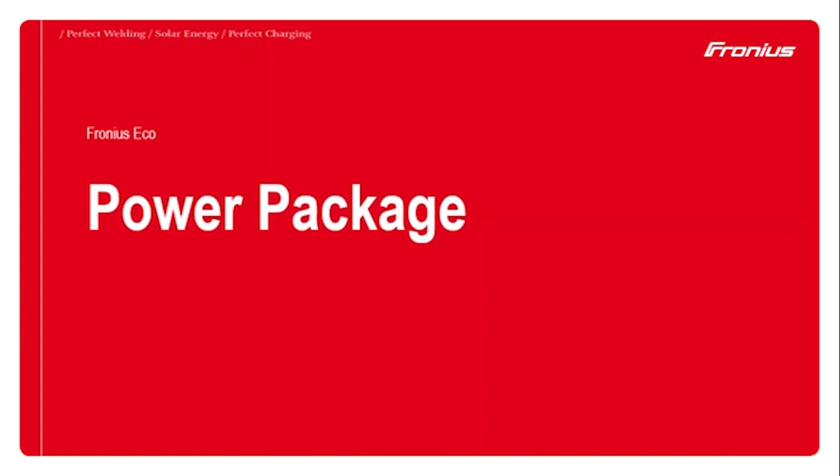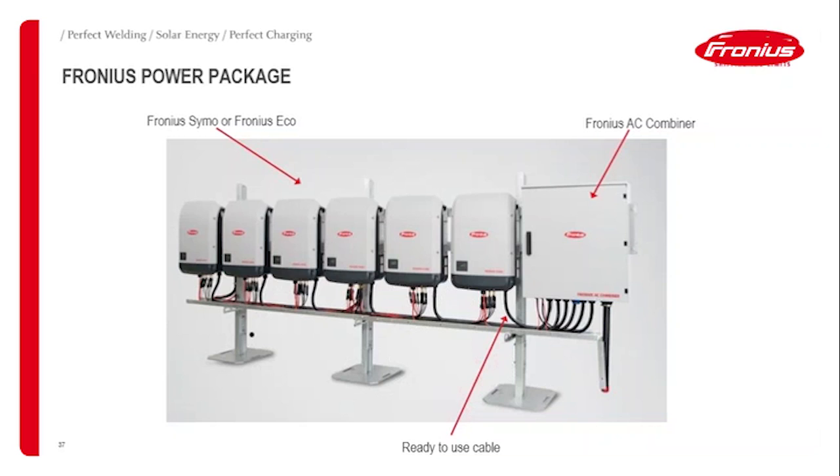So if you come across projects which are really large or ground mount installations, we've got this possibility to go with the power package. The power package is basically an arrangement of multiple Symo or Eco inverters in conjunction with the AC combiner box and pre-manufactured cables. So it is basically an individual package that we can customize for you. For example, you can go with the inverters and the combiner box, but without the cables. You can choose whether you want MC4 plugs or not, or still go with the screw terminals, for example, and so on.